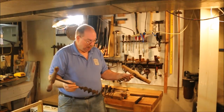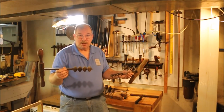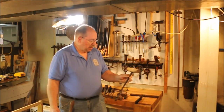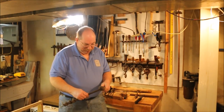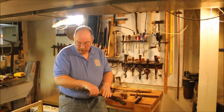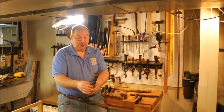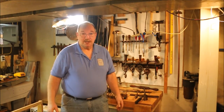These two I think I can do something with. What I expect to do is turn them into bits for the beam drills. This one has a handle on it that was made up out of some firewood - somebody cobbled this on there just to be able to say that they've done it. This is an antique but it's really in rough shape. It won't stay in there anymore. The lips on the drill are pretty good but they've been sharpened the wrong way, so the timing is off on the drill bit and I'm going to have to retime it and make it so it'll cut again.